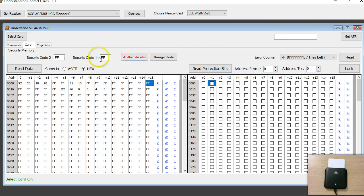Here are the buttons to authenticate. As the documentation says, this tag has only two bytes of password. You can authenticate, and you can change the password — even though there's no explicit command, we know the passwords are stored at addresses 1022 and 1023 so we just write there. You can also read the protection bits — clicking here brings all 1024 protection bits from the card and updates the screen. You can also use the address range tool to lock a range of addresses.